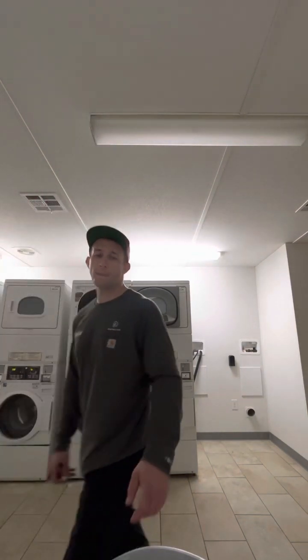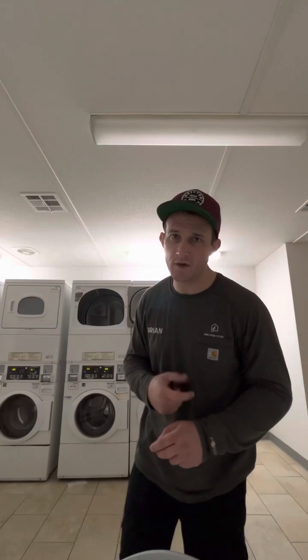Do not make the mistake of being suckered into paying a couple $100 more for the carbon monoxide monitoring system on all of these new generators. It causes issues, and that's it. They're too sensitive, and a gust of wind will shut it down while you're doing an event. And then you gotta wait 15 minutes for it to reset itself, and then bam, it shuts down again. You're gonna end up paying someone to bypass it for you. It's a waste of money. Don't buy that. Get the option without the carbon monoxide alarm, and go buy yourself an actual fire alarm / carbon monoxide alarm that you would have in your house and have it inside the trailer. That's all you need.